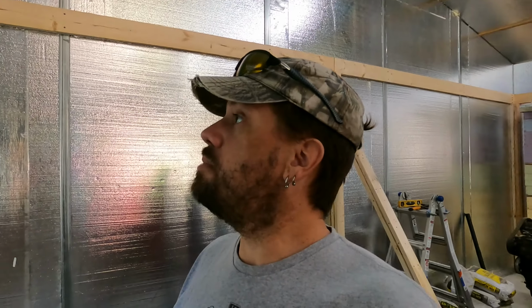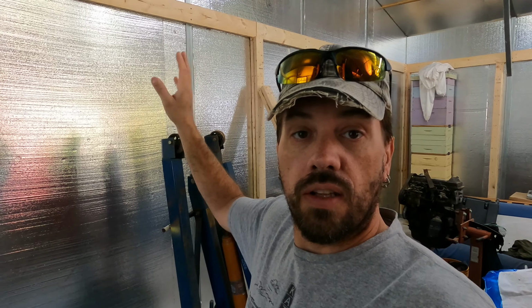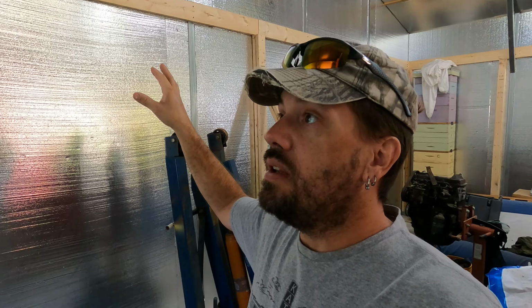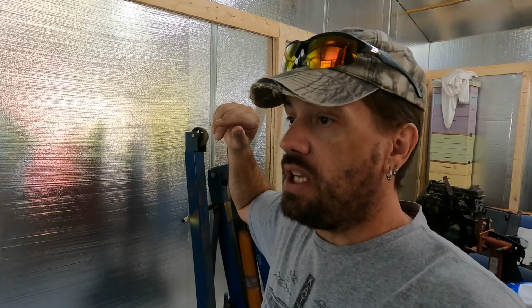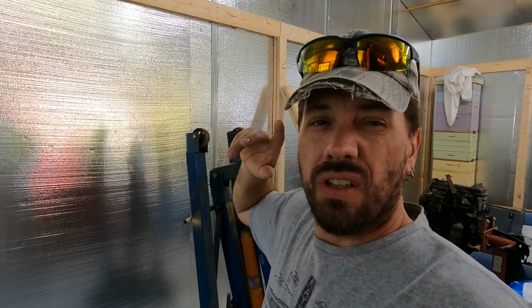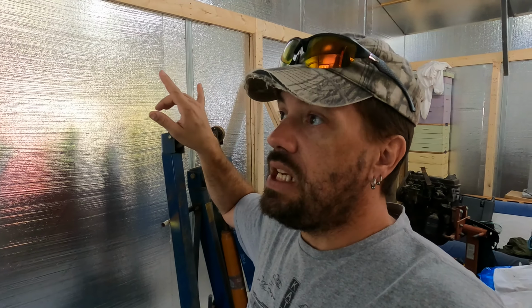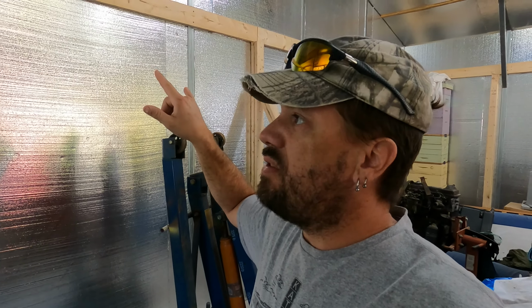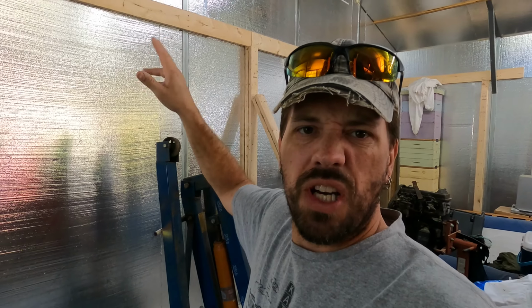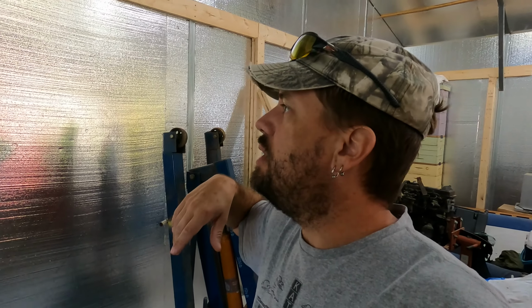All right, at this point we've got everything in, roughly. What we need to do is go ahead and laminate this back beam. That way we have that all set, and then we can start working on the front beam. And while we're at it, we're going to get the lamination part all set up. So I need 6 strips that are 5 3/4, or whatever a 2x6 width is. I'm going to show you a trick so that I get the right width every time.